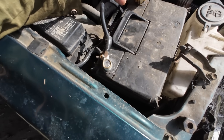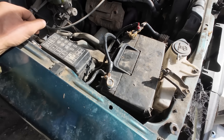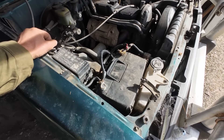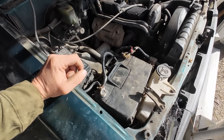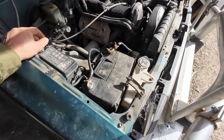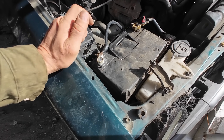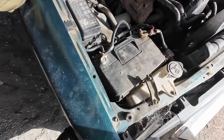I think next time I'll do it better. Now the battery shouldn't leak any battery acid and that should be fine for a few more years. I got the kit off AliExpress and it was about $40 New Zealand. I know some people use just a normal welding handpiece and they get the rod out of a battery and can use that as well, but the kit's cheap enough and it comes with everything you need. I was a bit worried about the battery popping because that hole was going right through to the inside of the battery, but it didn't do anything bad. Yeah, always a good idea to wear a mask and gloves — it's definitely worth doing instead of chucking a battery out. You can just rebuild those poles.